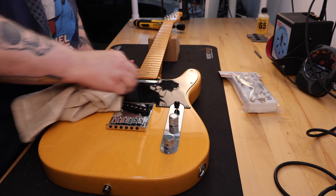I will have to compare them to the new Fender Cobalt Chrome Telecaster pickups to see if they're similar — using the same type of magnets, it seems like they would have a similar sound profile. Introduced in 2004, the SCN pickups were designed by Bill Lawrence with the intent of reducing noise while improving the single-coil tone of the pickup. The overall design was based on using miniaturized Samarium Cobalt alloy magnets instead of Alnico 5s. Samarium Cobalt is a rare earth magnet that is far more powerful than the Alnico 5 magnets traditionally used in pickup design. When I measured the pickups, the neck pickup resistance measured at 6.5K ohms and the bridge pickup resistance measured at 11.5K ohms.